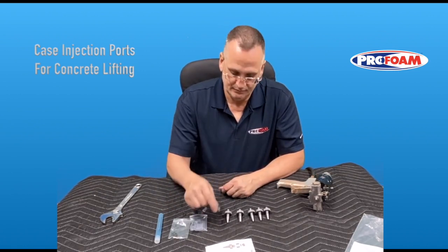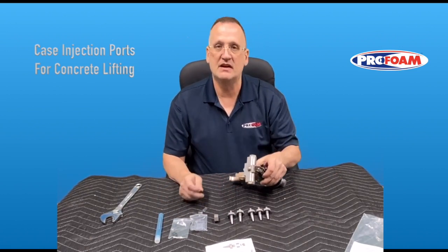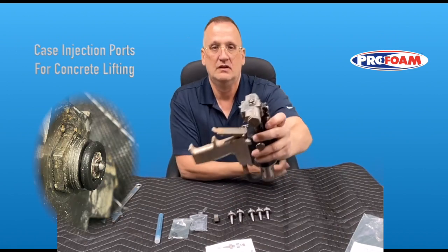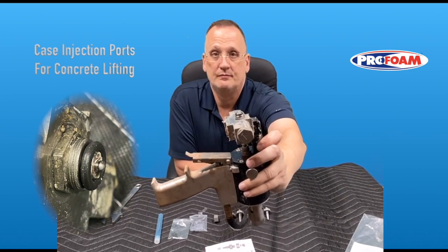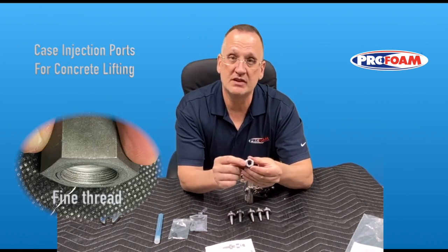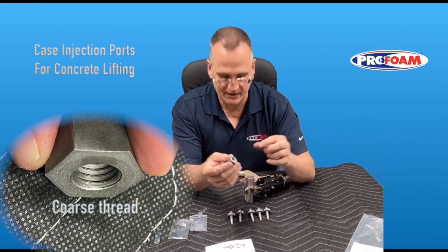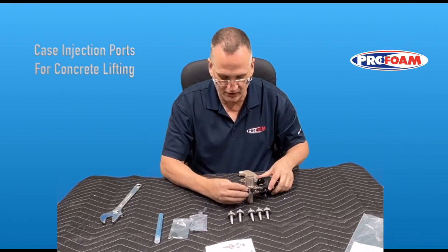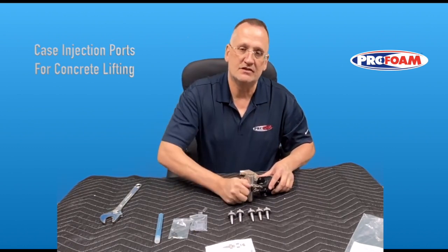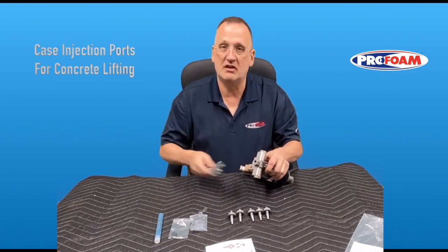There's an adapter and five of the ports. We take our PX7 or GX7, put our O-ring right on the front, just like that. Next we take the adapter — one side has very fine threads, the other side has coarse threads. The fine thread side goes onto the gun right over the O-ring, and you thread it on. It does not have to be very tight — snug it up by hand and just a little snug with an adjustable wrench. That's all you need.